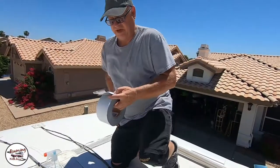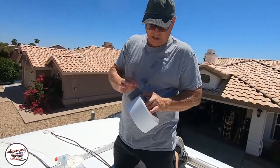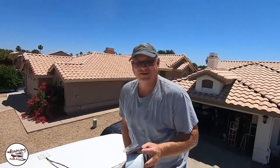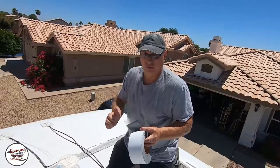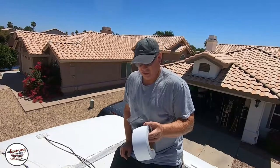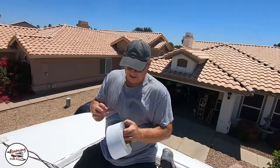The side that's going to be facing up toward the sun — the side not sticking to the roof — has this white outer layer. And then this gray part is the part that actually sticks to the roof. If you've ever been in a parking lot and stepped on gum and tried to get it off — good luck with that. This has a clear backing so it can wrap within itself. But once you pull that off, you want to make sure when you place this, you place it exactly where you want it to be because it's not forgiving. It's going to be really hard to get back up.